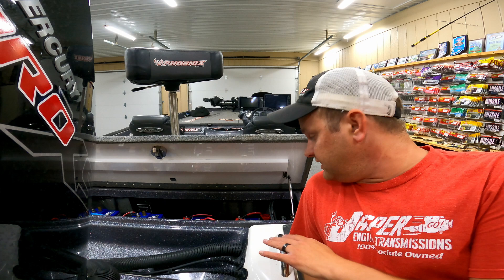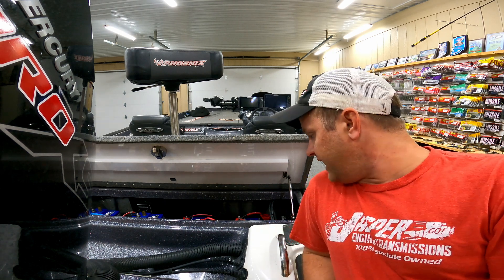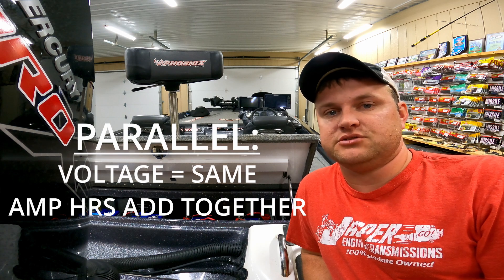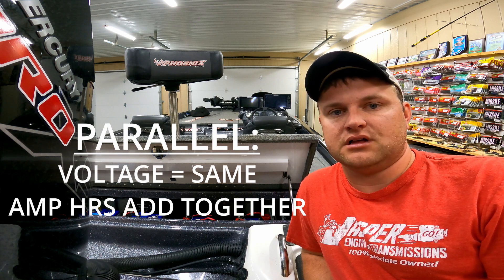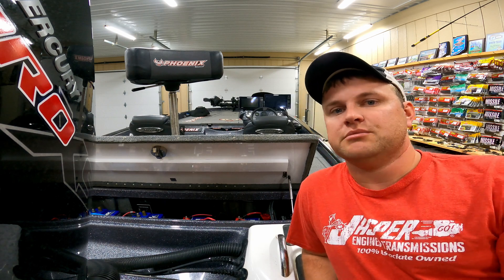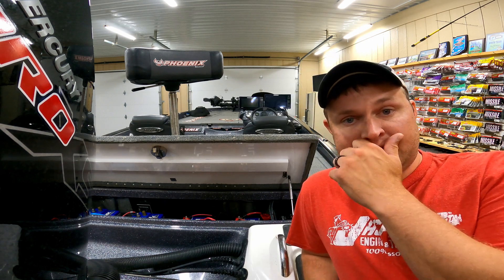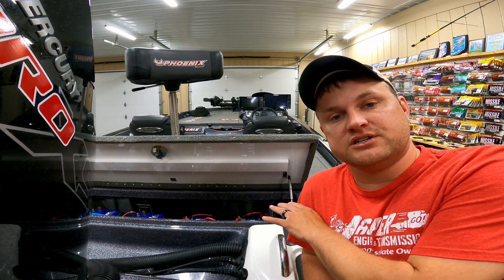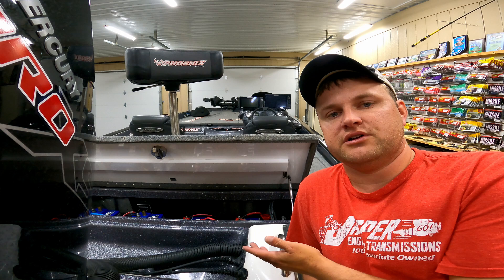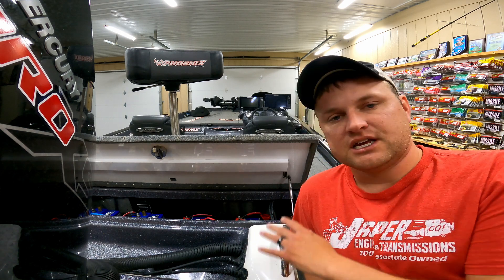So as you can see, it's pretty straightforward — all you need is those two jumper wires and you can basically add a lot of reserve capacity to your batteries and allow them to last a lot longer. It's going to take a little bit longer to charge, but you're adding that reserve capacity. In this case it'll be 125 amp hours plus 125 amp hours equals the 250 amp hours that I have controlling this boat.